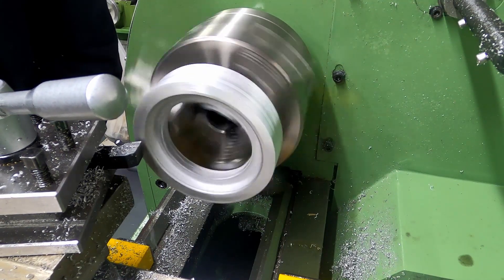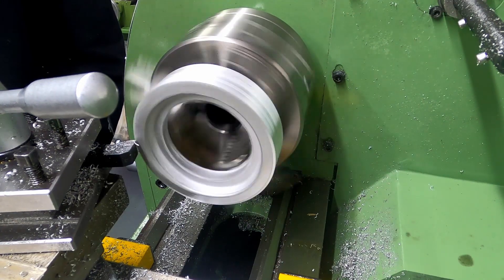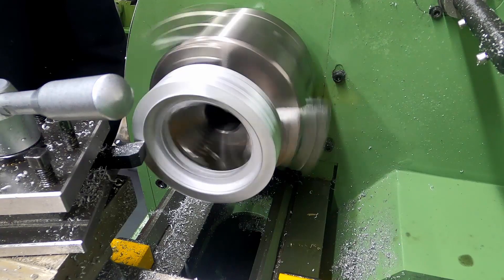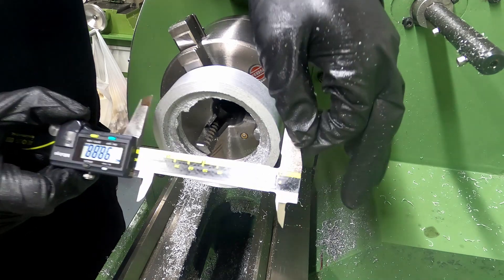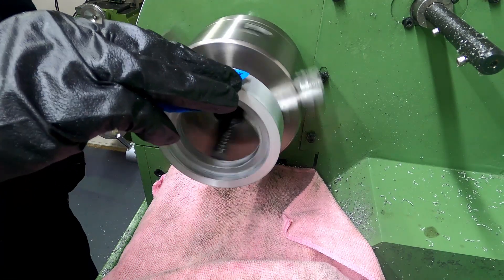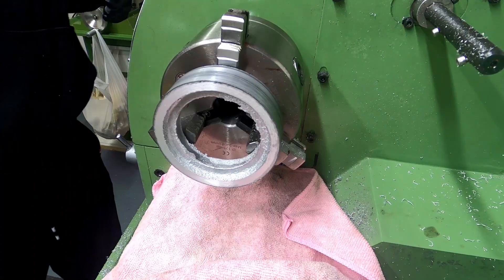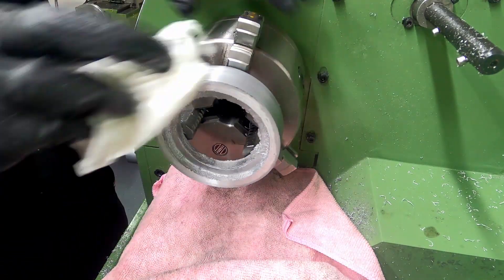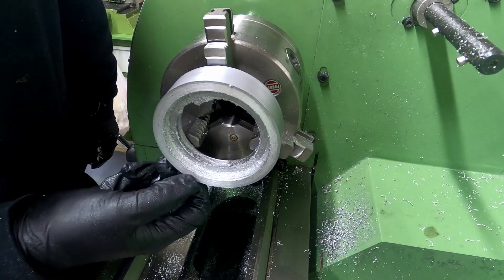The backing of the rim is quite a bit more. I'm aiming for 98.42 and it's 98.47 — I think I'll leave it at that and just give it a bit of a polish. I'll clean this front edge up; it's not far off.